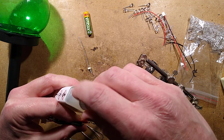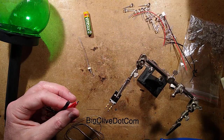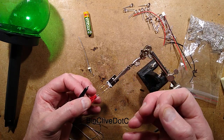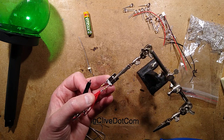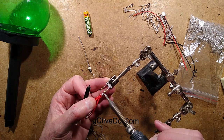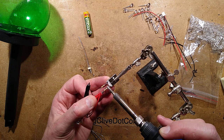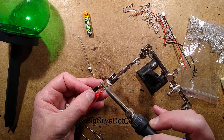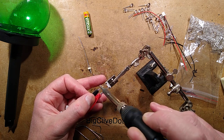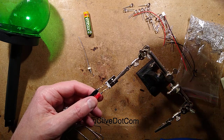This Topnik RF800 is an alcohol-diluted flux - you have to be careful because when you apply flux it evaporates and just leaves a film. I'm going to float this on the outside and solder directly above my fingers. That looks dangerous, but I'm fairly used to soldering so it's not a hazard for me - though it's not something I'd recommend if you're new to soldering. Soldering above your fingers could carry a very harsh lesson.